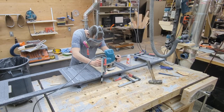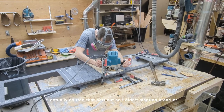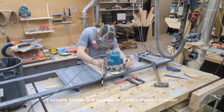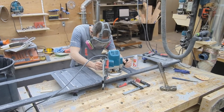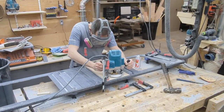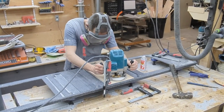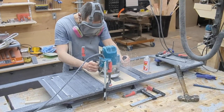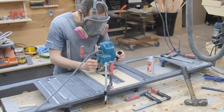So in this van, I decided to do a little experiment and try to remove some of that material from the underside. As I had mentioned earlier, you can buy solid surface materials in 1/4 inch. They say it is not recommended for horizontal applications, but I would love to get my hands on some. That said, if you buy through solidsurface.com, you have to buy 2 sheets, and nobody locally has ever carried any that I could find. So as a result, I decided to just take that 1/2 inch material and see how much I could hog out from underneath.